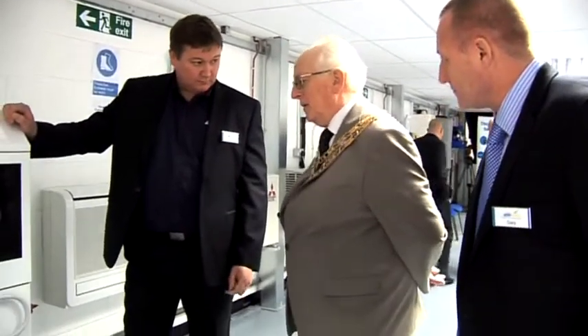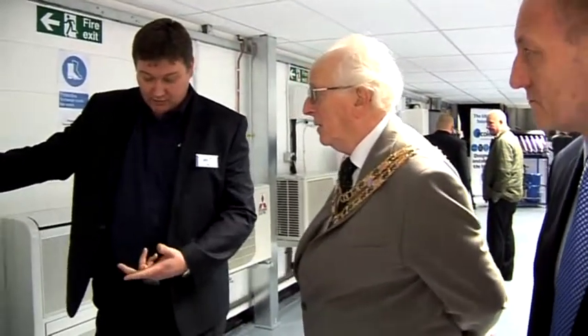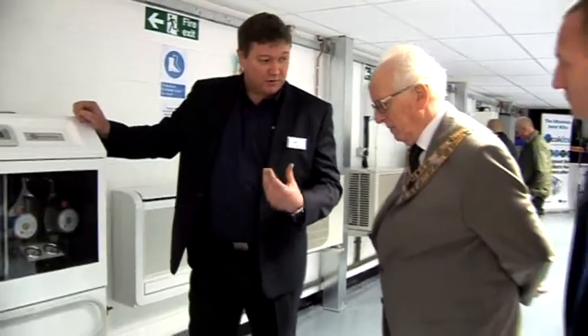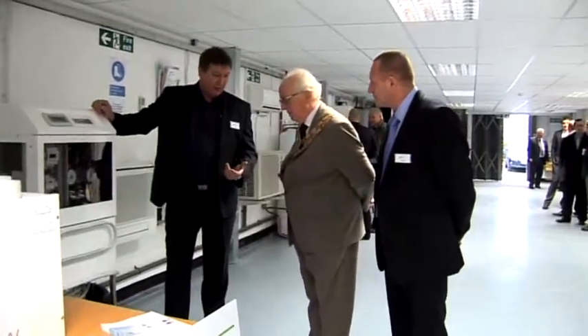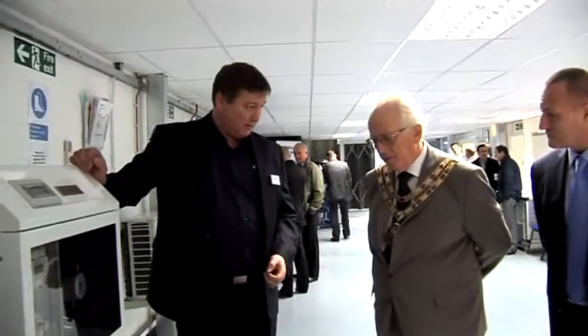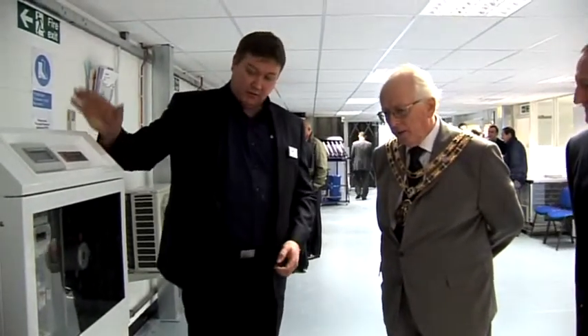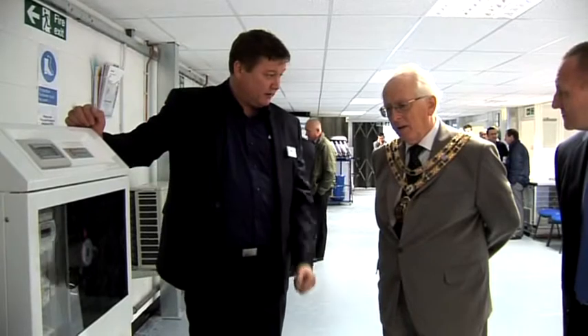Is this still considered something that could be used in a domestic property? Absolutely. The only problem with ground source is space requirements, because you often need quite a lot of pipe to give you the energy requirement for the property. It does cost considerably more to install than air source because there's a lot more work involved to install the pipework. If you're very tight on space, you can actually bore hole and drill down — like they would for water wells — and feed the pipes down vertically. In a new build, when they're doing the foundations, it's easy enough to do.